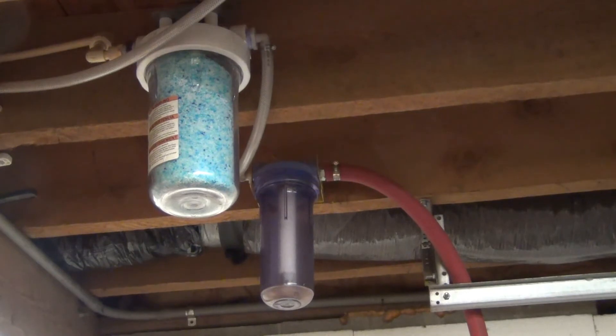What I would recommend to anyone doing this is to run a blow-off valve upstream of these housings — in other words, between the compressor and the housings. Run a safety relief valve, or pop-off valve. It's similar to the valves on a hot water tank that release pressure once it exceeds a certain level, so the tank doesn't explode.